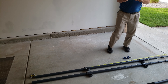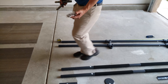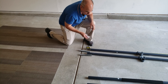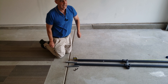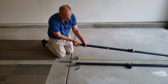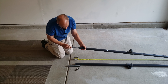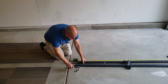The next thing is the base screw — letter N — and we also need D, which is the jam nut. At this point we're actually going to make the pole longer, because these base screws are about nine inches and we still need about six inches to reach 112. Here are the jam nuts — those tighten at the very last so nothing moves. There's a bung in the bottom of the pole with threads that accept these threads — that's really the key to the whole jack screw expansion process. These go in like so and tighten up.